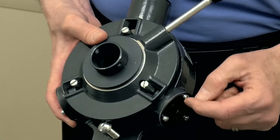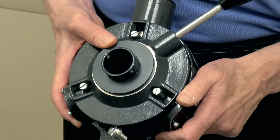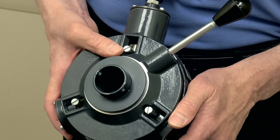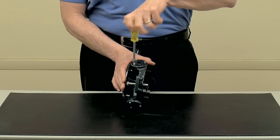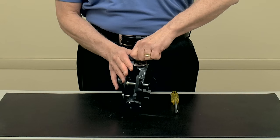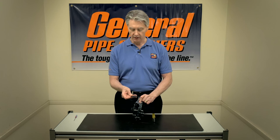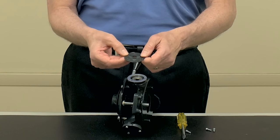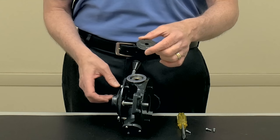What we're going to do is unscrew these screws, take out the swing pin, and get out the carrier — the piston, if you will — that holds the feed roller bearing, and we're going to change those. The first thing to do is unscrew the three screws that hold the disc on the power cable feed body. Notice that this disc is dimpled — one side is concave and the other is convex. You want to put it on the same way you found it when you reassemble the power cable feed at the end.